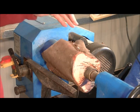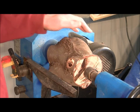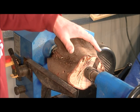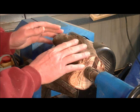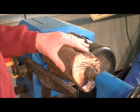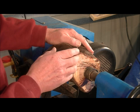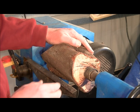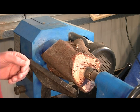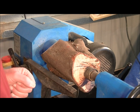I've taken off some of the protruding parts and I've determined that this is going to be the bottom and this is going to be the top. So what I'm going to do now is knock off some of the lumpy bits, make it somewhere near round and true up this bottom end, and make a tenon on here so I can turn it around and put it into my scroll chuck.